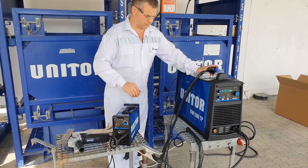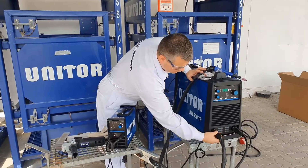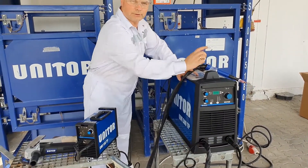Basically, we adjusted our shielding gas. The next point is, of course, connecting the TIG torch to the welding converter. By default, all of the units are TIG welding solutions. The torch is connected to the minus.